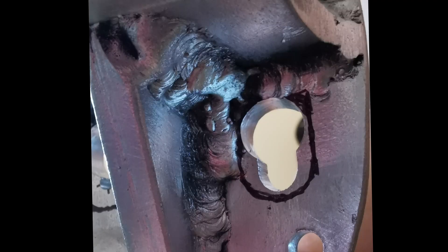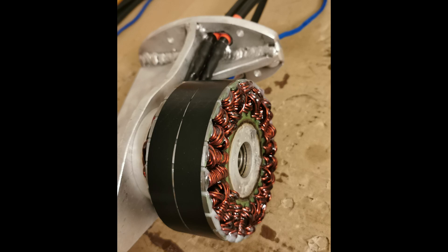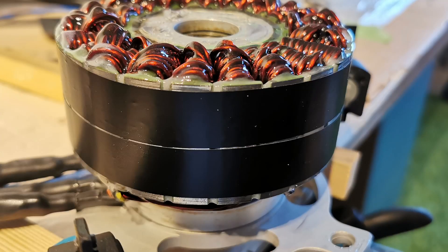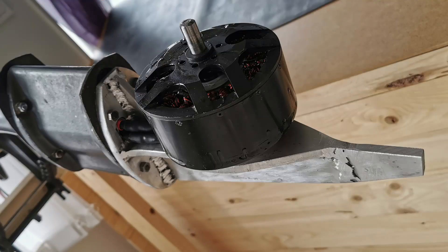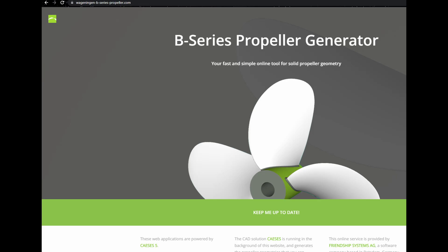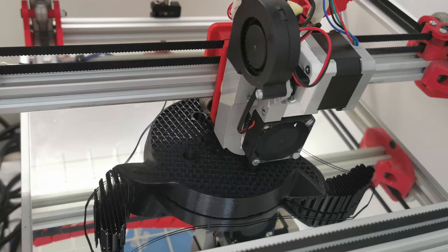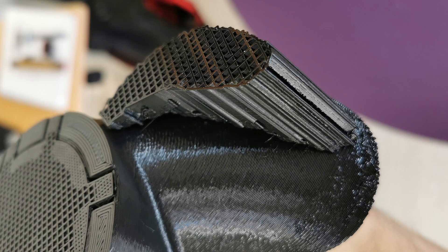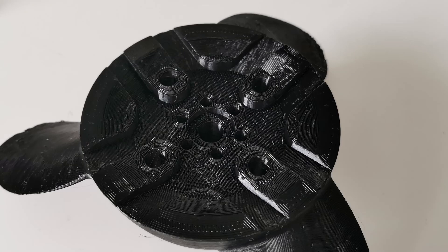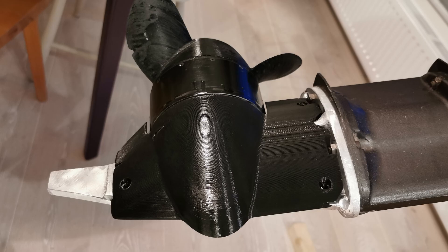I drilled and filed holes for the motor wires. The electrical tape is just to check that I have some clearance to the rotor, because when the stator heats up it expands, and if the clearance is tight the rotor could start to rub against the stator. Modeling a good propeller is really hard — I used a free online program that generates the propeller geometry for you, and I will link it in the description. I modified the propeller a bit in CAD to make it fit on my motor, then I 3D printed it in PETG. The rotor kind of sits inside the propeller, which makes for a really good transmission of torque. I also printed some covers to make it all more streamlined.